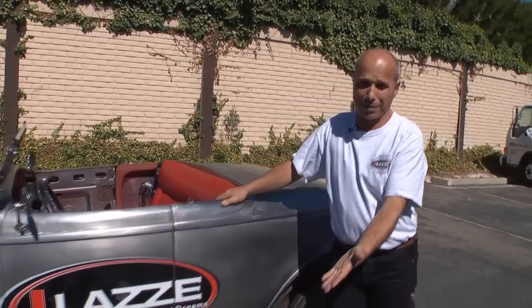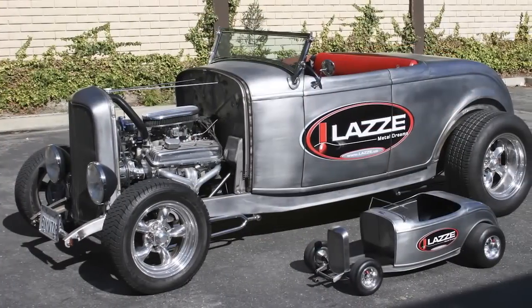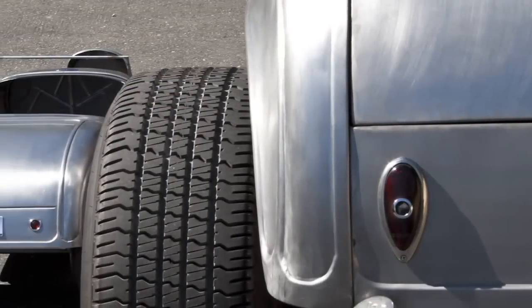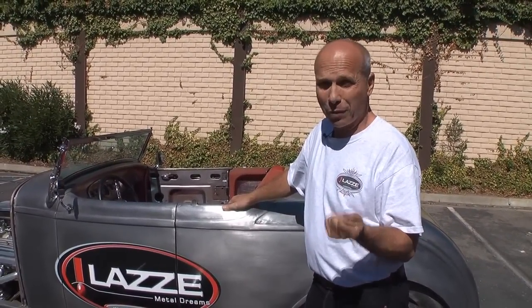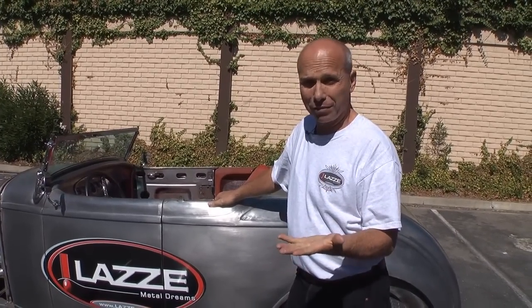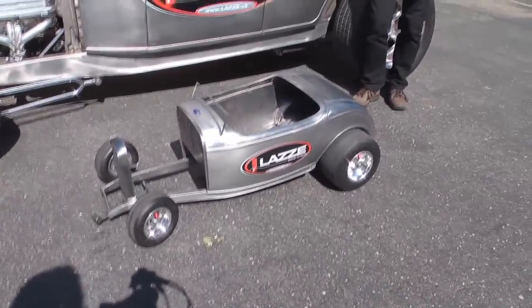So that you can see what can be done, and in front of me here we have a smaller version of it — and that's where you can see what can be done there too. What we do, and you've probably heard this before, is we can cut, bend, shrink, and stretch. Those are the four elements we're dealing with. When people understand what happens when we use one or more of those four elements in combination, we can control a flat piece of sheet metal — whether we're making it big or small. It's up to you what you'd like to do.